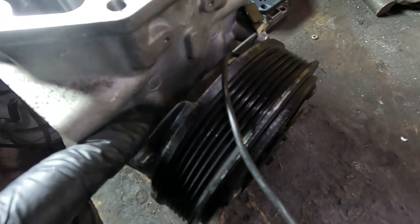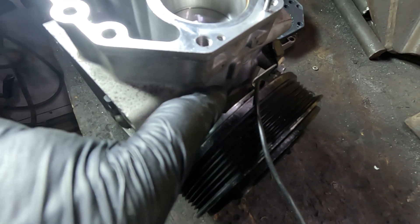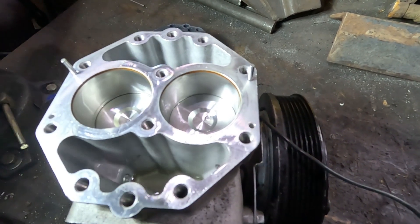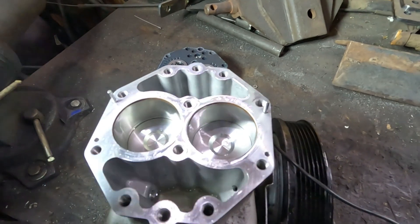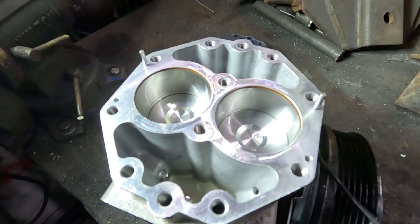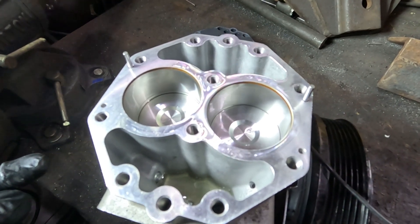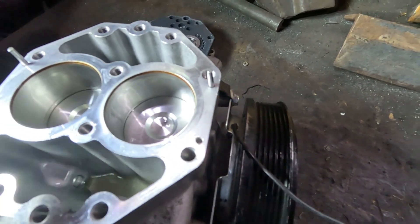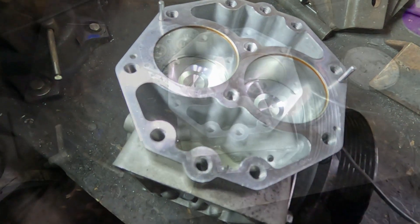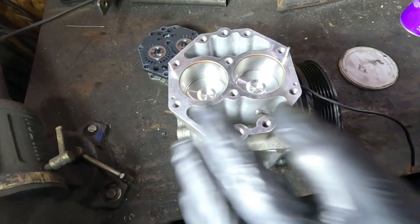Now I want to point out what's causing the problem. We identified this side of the compressor as the suction side. Down here, that right there is an oil passageway. On the outside there's a casting that goes all the way down — there's a little eccentric down in the hub that pumps oil up. Since this is the suction side, the refrigerant would be pulled in from here, run through the pistons, and out the other side. So the oil gets pulled in on the suction side and sprayed on the cylinder walls while the compressor runs. In a closed AC system that's great, but since we're turning this into an air compressor, that puts oil in our compressed air — and we can't have that.